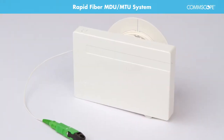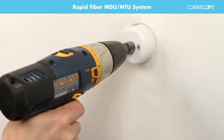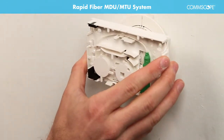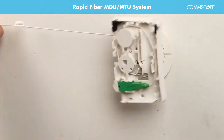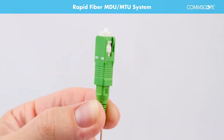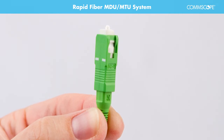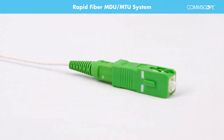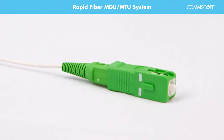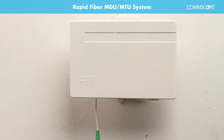To bring fiber into the living unit, Comscope offers the Rapid Fiber Faceplate Solution. The faceplate mounting bracket installs in the wall, connecting to the Rapid Reel Cable spool and faceplate assembly. The connector is removed from the parking bay and hauled toward the distribution terminal for connection. The Rapid Fiber Faceplate leverages Comscope's 1.2mm small diameter cable, which offers 65% space savings over 2mm cable and is proven to be three times stronger than larger-sized cable. Any remaining cable slack is easily stored back on the Rapid Reel assembly, and the cover assembly is secured to complete the installation.